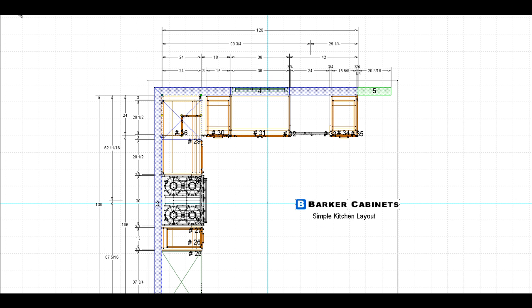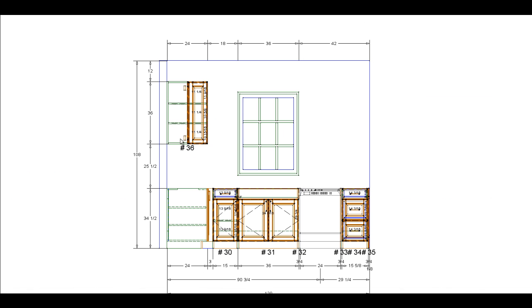All right, so we got our wall 90 cabinet in there. And just so everybody knows, you're going to need to make sure you measure the height of your ceiling. So I got it from finished top of the floor to the finished bottom of the ceiling. I have 108 inches. Now, I'm not running these cabinets all the way up to the ceiling because nobody's going to be able to reach up 9 feet tall. I mean, that's just not going to happen. So I leave a 12-inch wide air soffit, is what I like to call it.